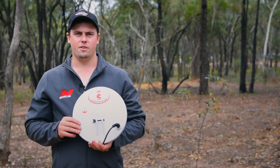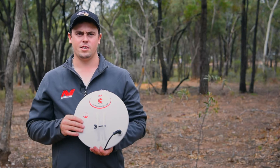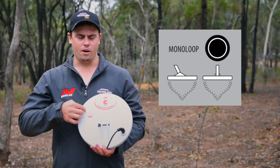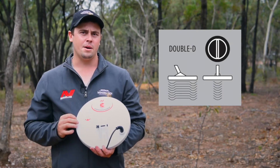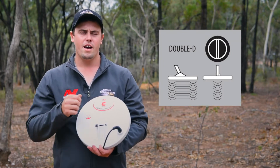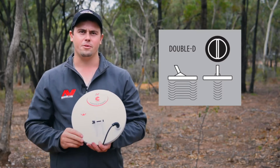The first thing we need to do is establish what is the difference between a mono coil and a double D coil. It's really quite simple — a mono coil has copper linings that consist around the outside of the coil; nothing happens in the center. A double D coil has two opposing D's inside the coil, and your most sensitive part is where those two overlap, going the whole way down the middle.